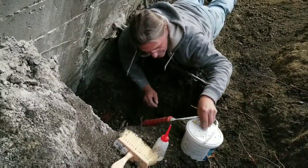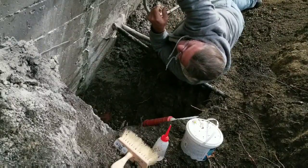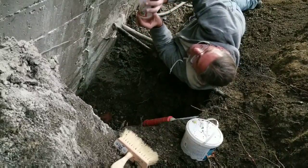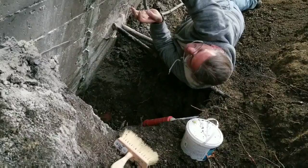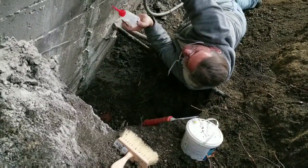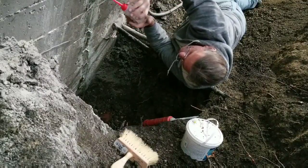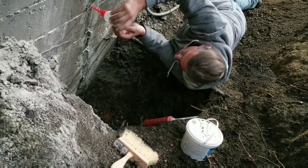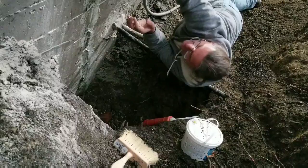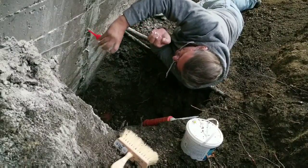But being that I have some, I guess you could say, trust issues, what I also do is I have with me a little bottle that I use as a trick, where I go through each one of these and I squeeze water into it. And like I say, what this will do has helped to activate the grout once it makes it inside the crack. There's kind of no use for the plugs at the moment. I might as well let atmosphere pressure into the wall to aid in the filling of the crack.